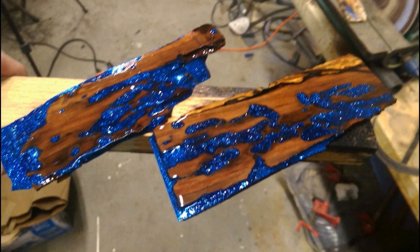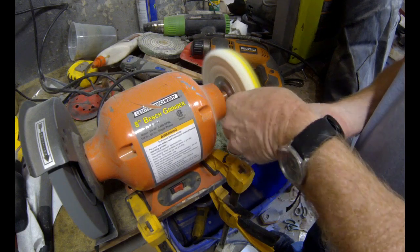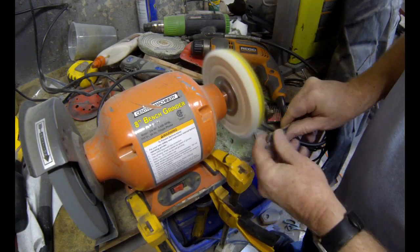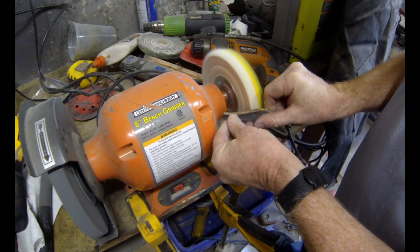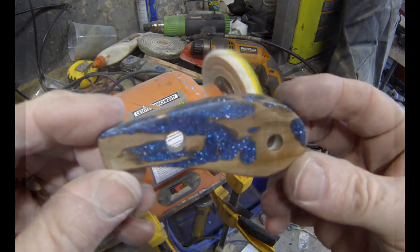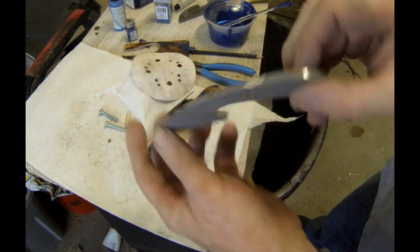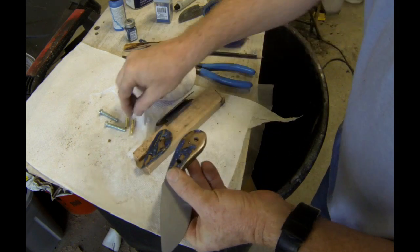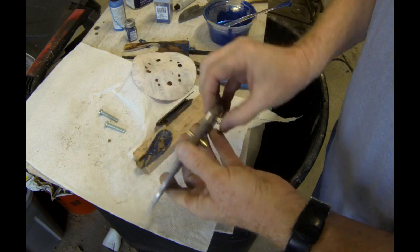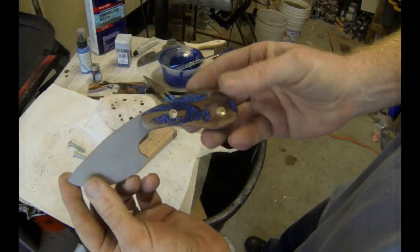I threw the wood into some polyurethane mixed with paint thinner so that it would absorb deep into the wood, just to preserve it so it didn't crack in the future. Then I cut out the scales into the shape of the knife handle. Unlike most of the knives I do, where I cut the scales oversized and sand them to shape once they're mounted, when you're doing a glass bead finish knife you can't do that. You've got to cut out the scales perfectly so that when you mount them they really don't need any additional grinding or forming, because you don't want to damage the glass bead finish on the tang or spine. This is just a test fit, trying each handle in place with the brass pins that will hold them.